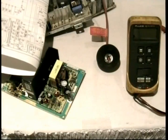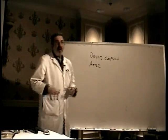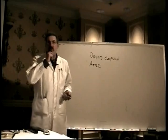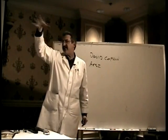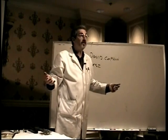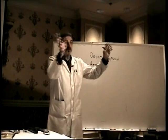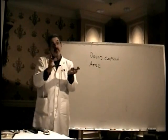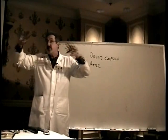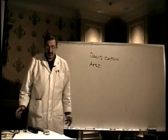They're all the 900s. Therefore, when you have a problem, it's simply a matter of checking all the parts with that particular number in general. In other words, if you have a power supply problem, I can say to you, look, it's one of them 100s. Change every capacitor that starts with the number 100 or whatever. And so that makes your job real easy. Is everybody with me on the concept there? It's really cool. That way we're not wasting our time checking the windshield wipers, right? If I have a power supply problem, that's a number 100. All the 900s, 200s, 300s, those are all windshield wipers. That ain't my problem. Whatever my problem is, it's in that circuit. So that's kind of a cool thing.